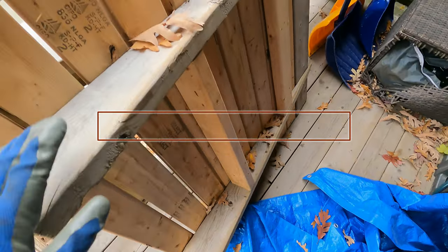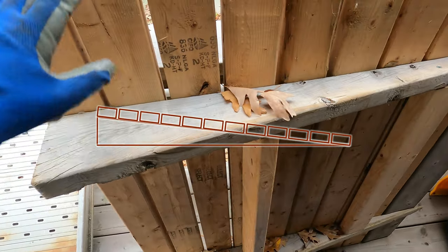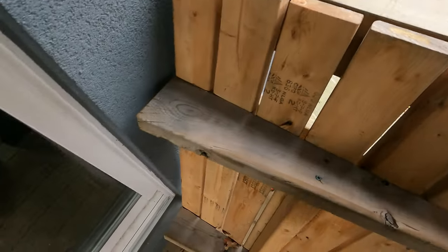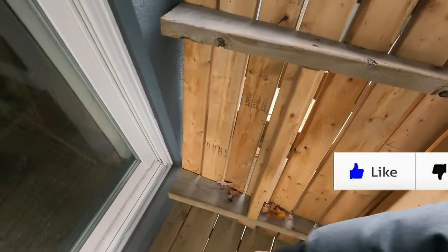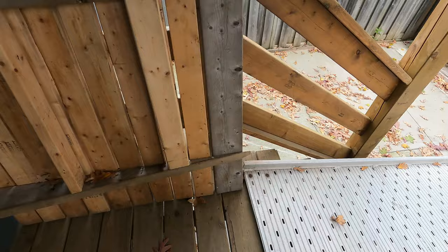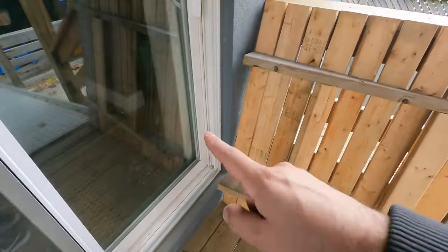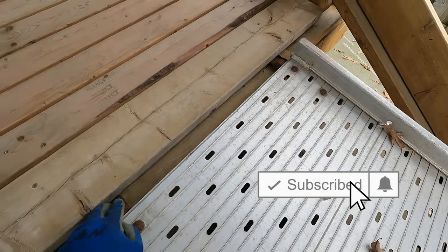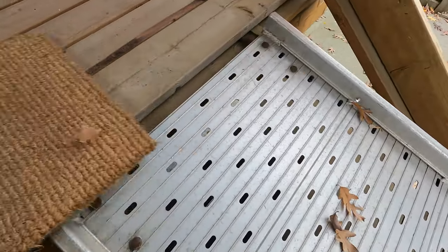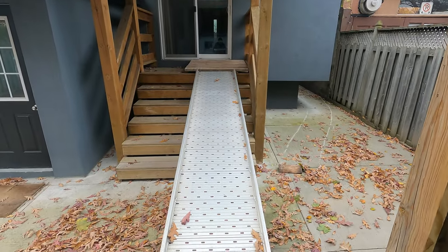These two pieces are the same piece of two-by-six cut diagonally. I grabbed a bunch of two-by-four ends I had lying around and screwed them in. You can put a couple pieces across the middle for extra support. This is cut so that the rise matches here. You could get away with using two-by-four cut in half if your step up isn't as high, but for me two-by-six was perfect. We're going to have one continuous ramp from about 19 feet all the way inside the house.